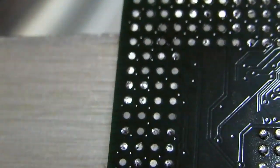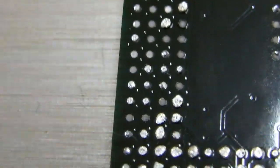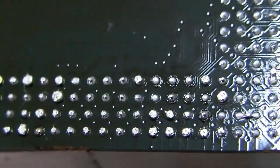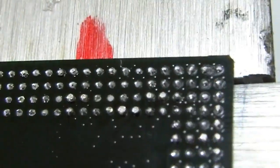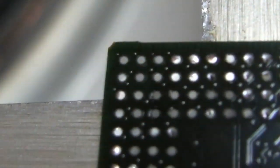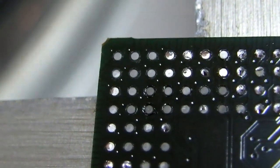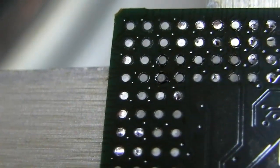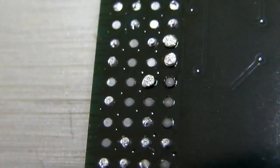Yeah, I can't tell looking through the camera. Some of those pads don't look like they've ever been bonded properly, and this is what I saw when I was looking at this a couple of years ago on the other Samsung mainboards. Majority look okay until you get to here. If you can see, those pads, the top three on the left and some below that, look a darker colour, and I'm pretty certain when I get this in my hand, take my glasses off so I can really look close, I don't think they're going to have bonded in the first place from the factory there.